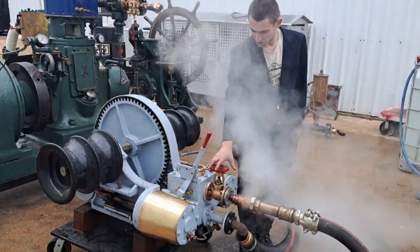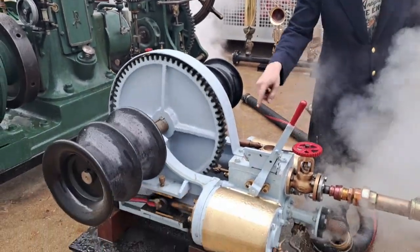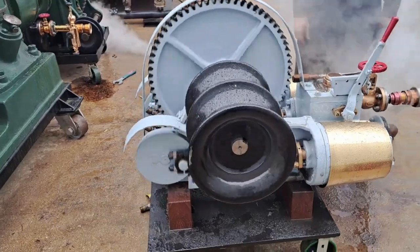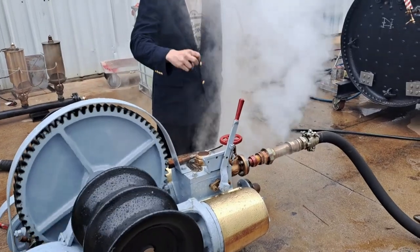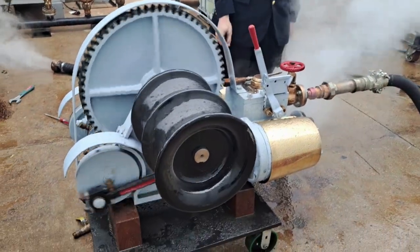This is a Reed and Sons steam windlass — pretty straightforward. Two high-pressure cylinder blocks driving a crankshaft driving the windlass, that's all there is to it. The reverse is not accomplished by any valve here on the surface; there's a four-way valve inside which flips exhaust and admission for both cylinders. It's as simple as that.